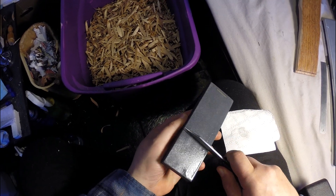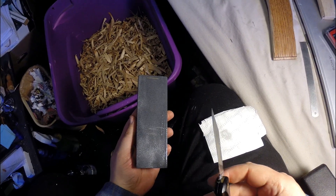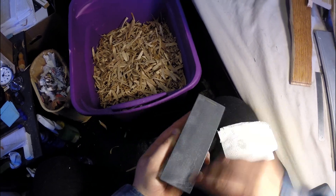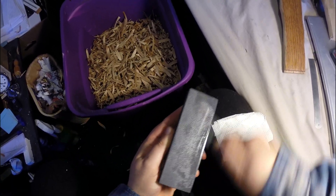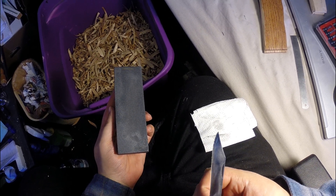There is a blow-up on screen so you can see there is some twisting going on. I cut off that damaged steel, and now I'm going to apply a secondary edge bevel of ten degrees per side, around three thousandths of an inch thick. You generally don't need to go to the full thickness of the damage you saw in order to stop it — somewhere between a half to three quarters usually does it.